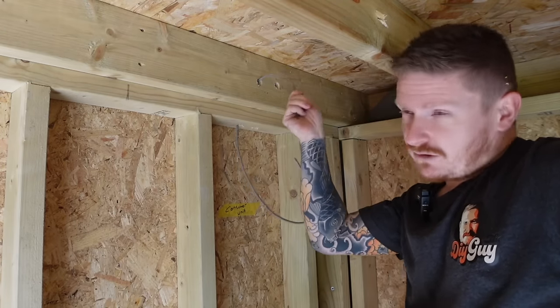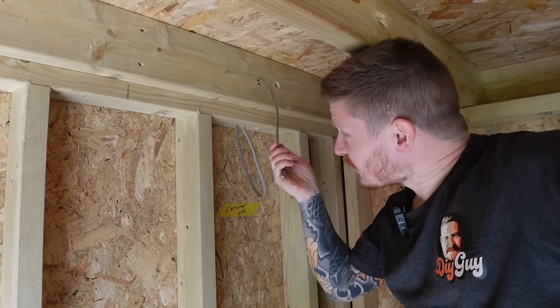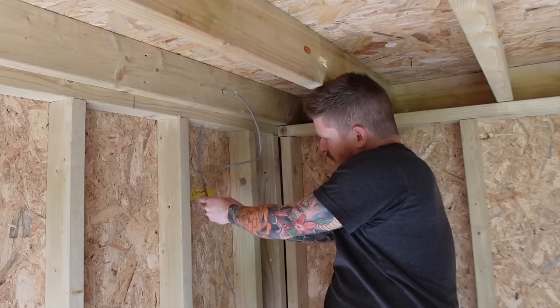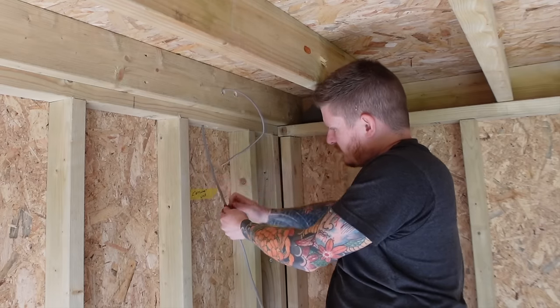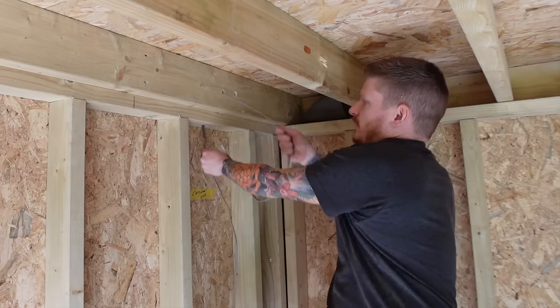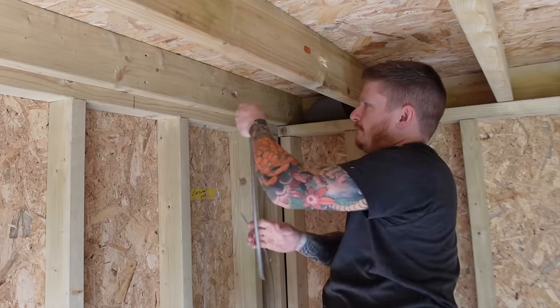I'm putting the feed into the switch — the consumer unit goes in here and I've got to get a cable up through this top plate, through a hole, and clip it all the way along this joist to the switch. It's quite difficult because of how I finished the end joist on the top plate, so I had to put a little draw wire in. I spent about five minutes off camera fumbling around, but I've got this wiring now — you can see I'm taping my draw wire to my cable, then I can just pull it through.